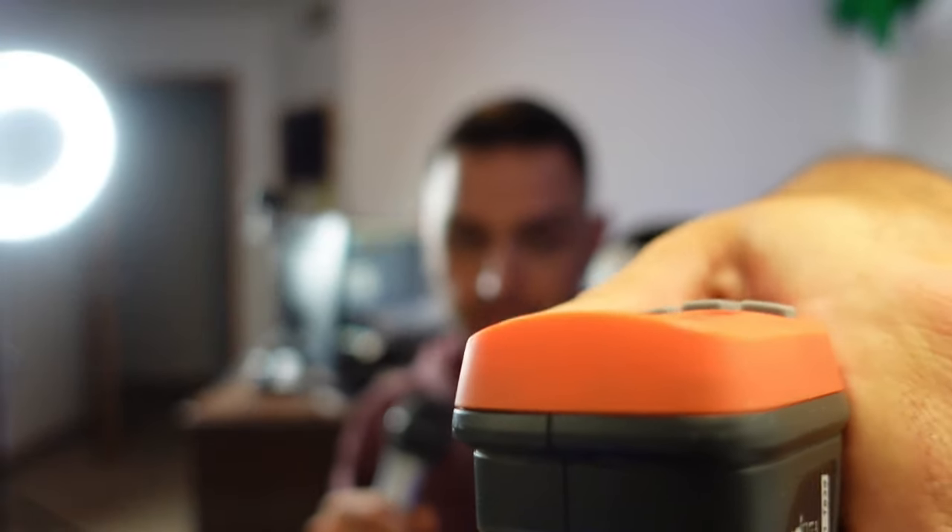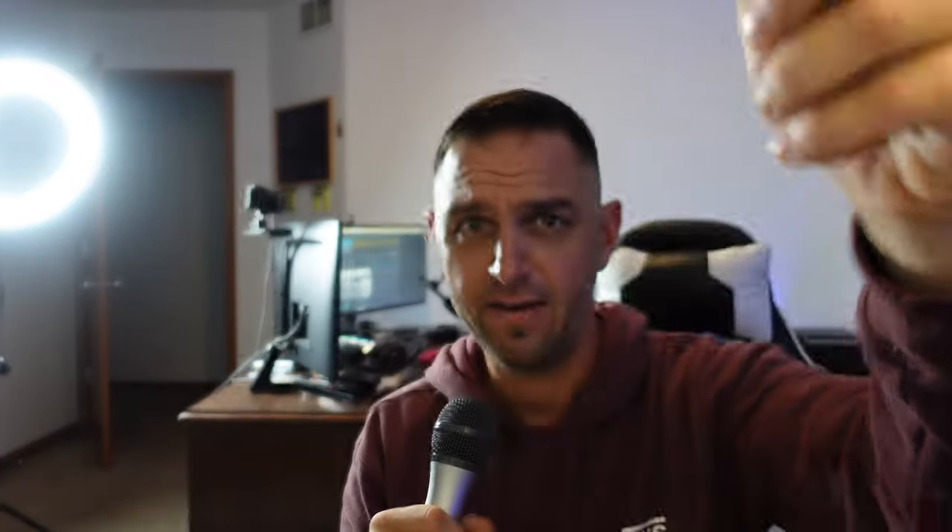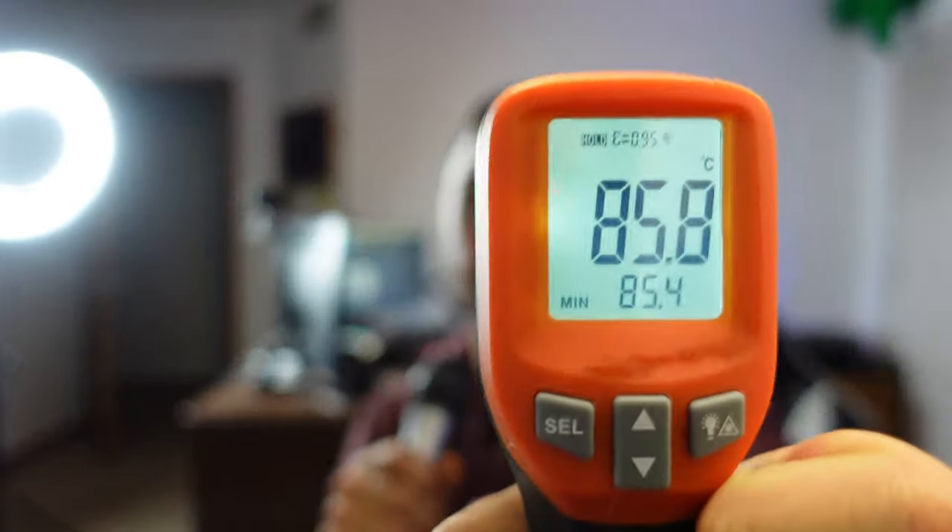Let's jump over to the 3D printer. This here is the Ames infrared thermometer, inside my 3D printer. According to Klipper, the program where I'm monitoring the bed temperature, it's 90 degrees Celsius and it's been steady that way for about 15 minutes. When I use the Ames toward the center of the 3D printer bed, it says 85.9 degrees Celsius. Let's check that one more time — 85.5. It looks like my bed temperature is not quite 90 degrees like Klipper's reporting, or this one's inaccurate.